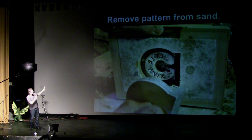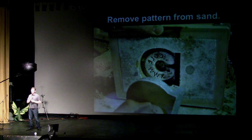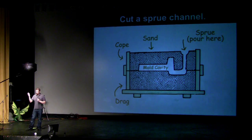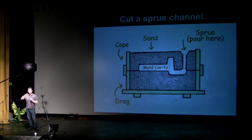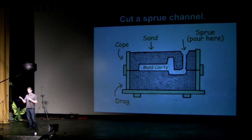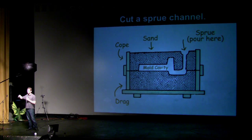Pull out your part and it leaves a perfect impression — here's the inside-out sandcastle underneath that sand. It really sticks together, it's amazing. So you cut a little channel using your finger or a bent piece of metal between the hole where the dowel was and the impression where your part was — that's called the sprue. A sprue is really important. You might think you can just pour into an open-faced mold, but the metal shrinks and needs to pull more metal in, so as it's cooling that sprue is instrumental.